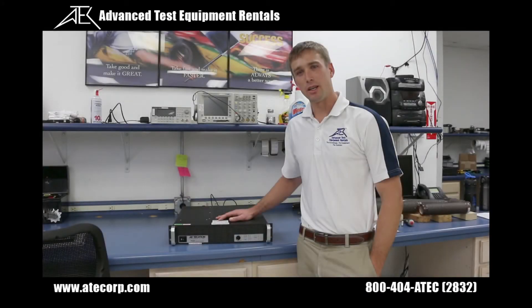I'll review again what the default settings are. The default configuration is controlled voltage, master mode, DC enabled, variable gain adjust, run on power up, unbalanced input selected, and power supply in auto range.